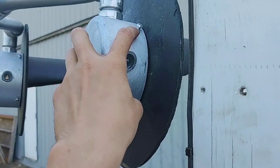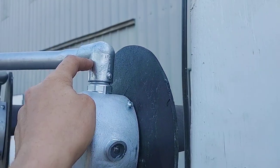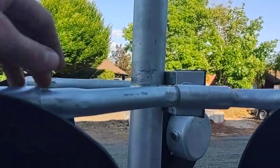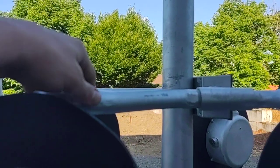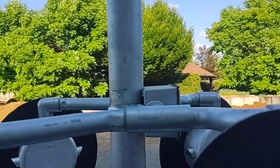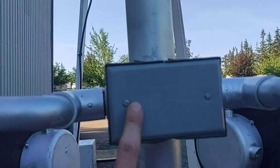I'm just using these screws on the side to keep the whole thing together, and of course there's an adapter right there that goes into a threaded elbow. These arms are a little interesting — I had to make a special jig to bend those, and to keep it from collapsing I also had to run a spring on the inside to get that bend. That's three quarter inch PVC, and then just a T and a metal — not PVC — junction box.